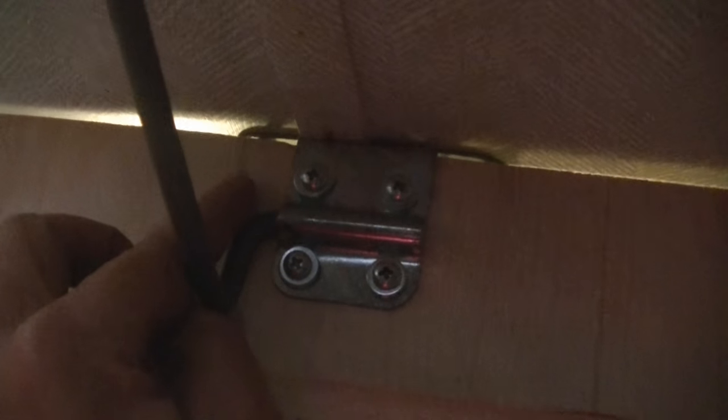The tricky part was back here — getting these brackets on right. What I had to do is have the leg fastened on, kind of put the table in place, with the brackets setting in here. My son was pushing and holding it up against the wall. I had to keep measuring — you can see I had a mark there, I had it way off when I first started — so I kept measuring and moving it over to get it centered. Then I got it centered and laid on my back and put all these screws in. What this rod here does is it lets you pop it out from the wall — you can lift up on the outer part, and those go up into a little bracket and pop out. Then this part here will swing down instead of up, and you can lay it on the bench part and turn this dinette into a bed.